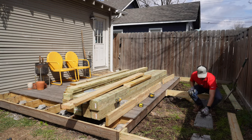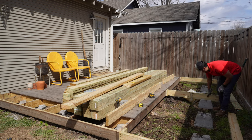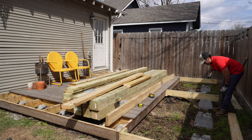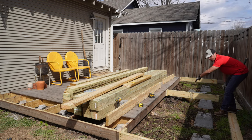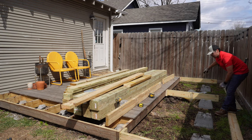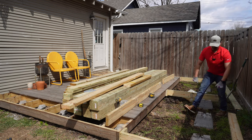The blocks are now set. Next I'm going to run a two by six across and attach it to the existing pieces on both sides, then attach the outside face, infill another two by six across, and do some intermediate blocking. After that we'll get going on the posts.